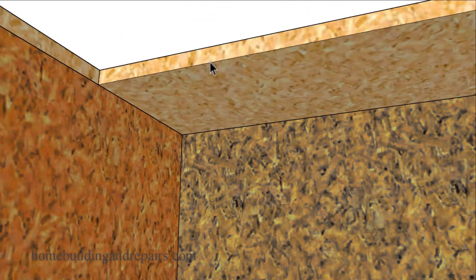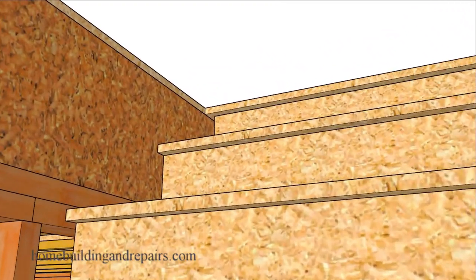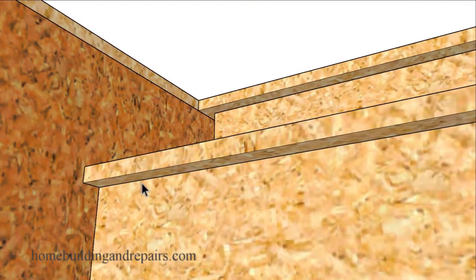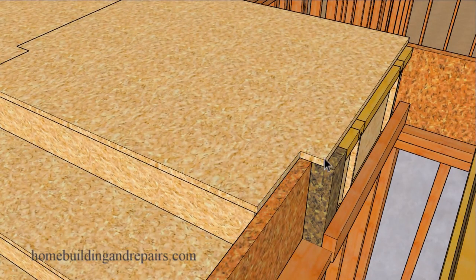In this example we are going to need an overhang — we need to extend the floor sheathing so that our tread overhang will work. We are going to have a 1-inch nosing or 1-inch overhang for our stair treads, and that means we're going to need it up here also. I don't have the floor sheathing breaking half on the joist or even half on the stringer — this isn't going to be a big deal because it's basically going to be supported by the stringer.